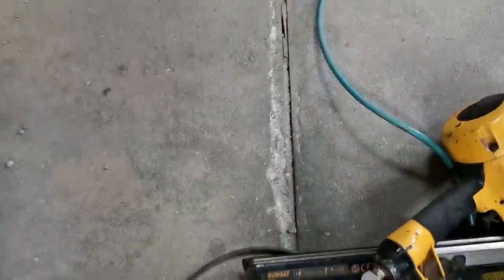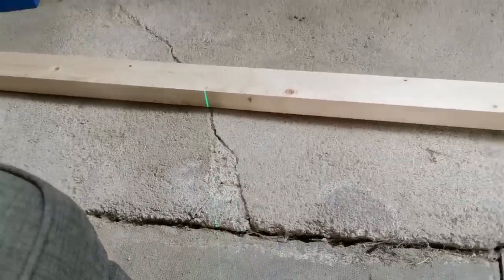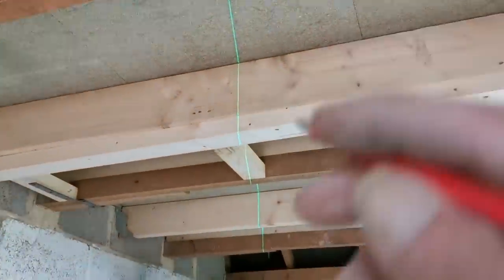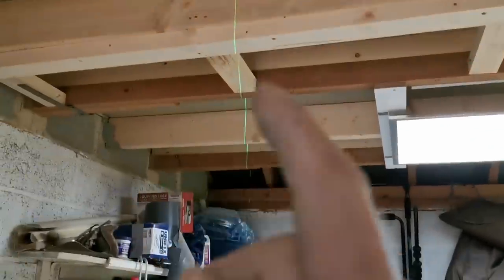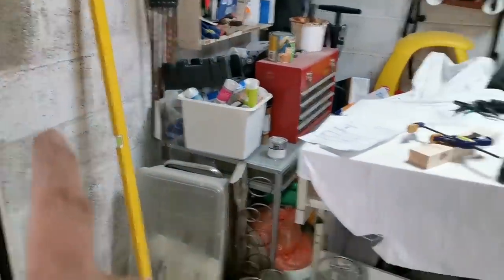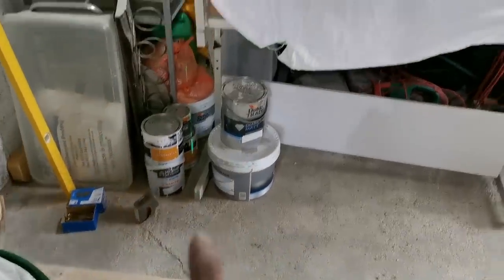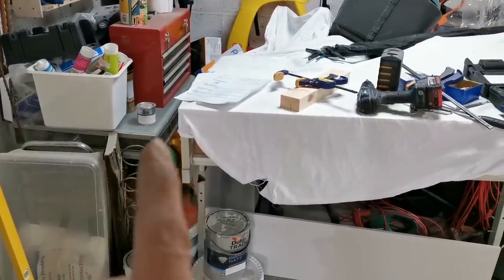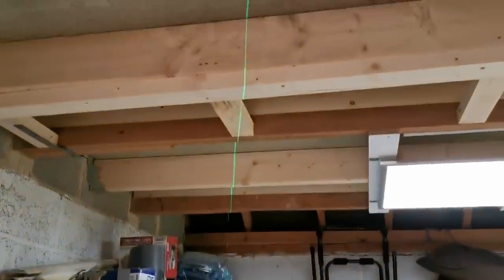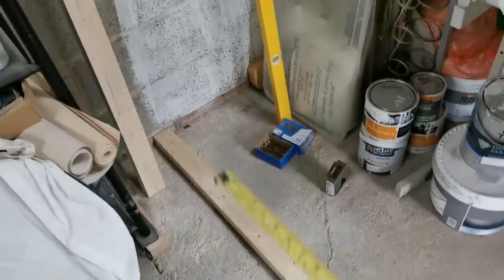Imagine that's my mark — get my laser on it, like a hat. That gives me the center of the top of my leg so I can fix it top and bottom. Then it's just a single row of noggins right along the middle. If there's a bend in this timber I'll start at one end and cut the noggin to push or pull that leg to get it straight. I'll show you when it comes to it.